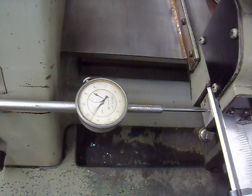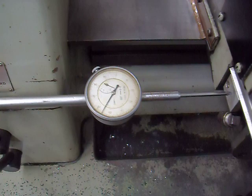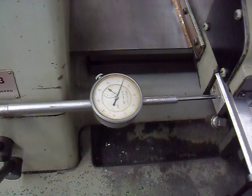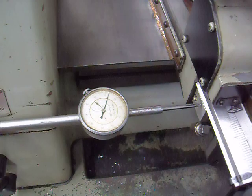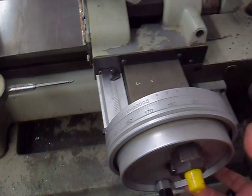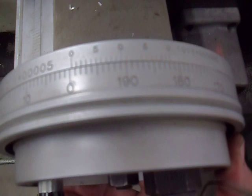I use this to do depths. Zero's at 12 o'clock, so I'll set a zero and then you can count — 50, 100, 50, 100. My friend Mark and I were talking about digital readouts. With this specific chucker, it's got a seven or eight inch dial — this thing is very readable, absolutely a joy and very easy to discern. It's got a vernier on top there for splitting thousandths.